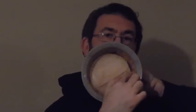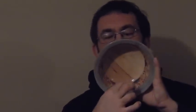You can see where the pencils broke out because I used Gorilla Glue to glue the beechwood to the pencils. It expanded and it went into the slight gaps where the pencils were, and then when they broke out it was just impossible to dig out and clean out all the Gorilla Glue that had wedged up in behind the pencils. So I ended up just filling it with pencil dust and sawdust and CA, and then sanding it back.